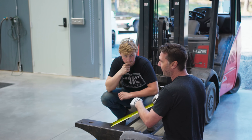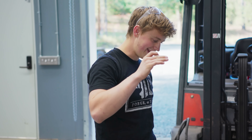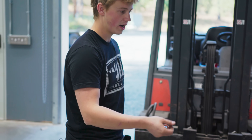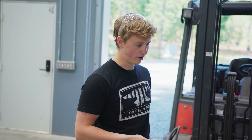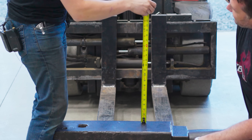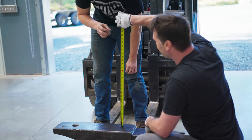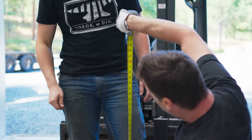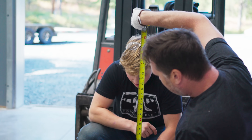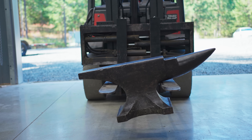As shop scientist, I want to see how far the ball bearing rebounds. Rebound is essentially how far an anvil will send up a hardened piece of steel — it's hard steel on hard steel, and the mass underneath determines how far back up it sends the ball. Dropping from about two feet, we're losing about two and a half to three inches. We're getting pretty varied results, probably because of the pock marking. Let's lift it up so the ground isn't dampening it and see how it rings.